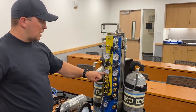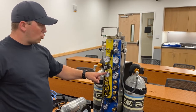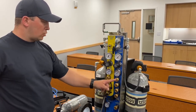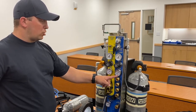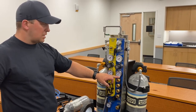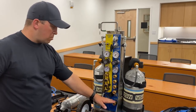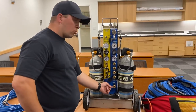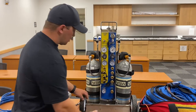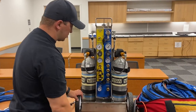We also have an outlet pressure gauge for the personnel side — maximum outlet is 125 PSI, and we normally set it to around 80 PSI where we have that black hash mark. For the high-pressure tools, these four connection points have a maximum pressure output of 275 PSI, designated by a green hash mark, and we normally set it to around 80 PSI for regular air pressure for high-pressure tools. At the very bottom on the blue side we have a low-pressure connection with a maximum outlet pressure of 125 PSI and a regulator to set the desired tool pressure.